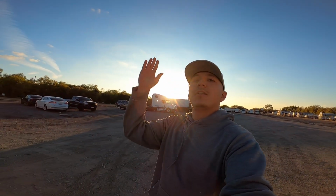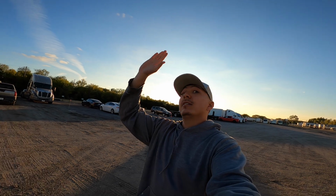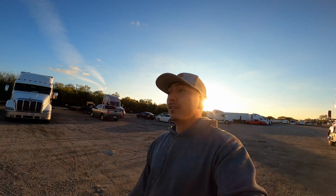The reason for that is these trailers tip over. So if you stand it all the way up and all the weight is on the very top and it catches, it's coming down one way or the other. It's taking the truck with it. So that's very important. And if it's ever in a situation where it's not level, set that sucker down, readjust, pull forward, reverse, come in at a different angle, do whatever you got to do, but don't pick that sucker up if it's not level.